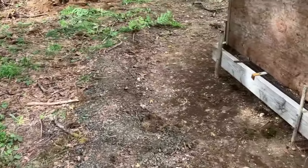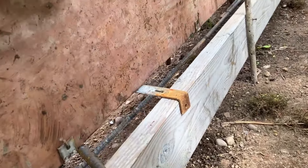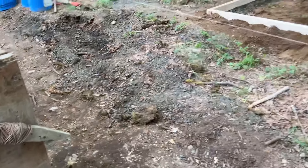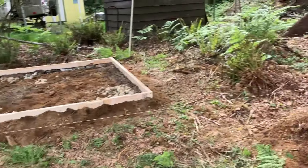I have to consider that the frost line against the house has to be 12 inches above the top of the footing, and so this might be a little bit of a steep slope towards the blacksmith shop, but I'll make it work. We've got a whole lot more fooling around to do.